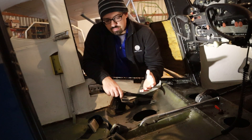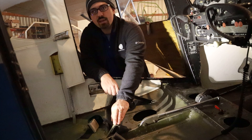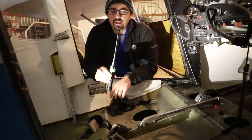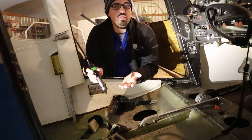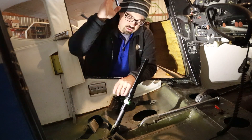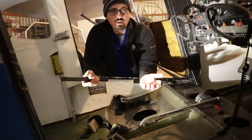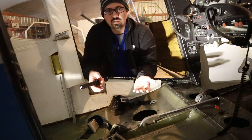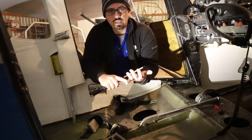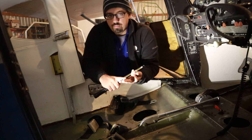I've got everything set up to comply with AD 2022-0803, verifying that this bracket is made out of steel. According to the AD, I need to take a magnet — the end of this flashlight is magnetic — and verify that this is steel. I'm going to do that now. It very much is magnetic; you can see it's just standing there attached. So the airworthiness directive is complied with — I've verified that this is not aluminum, so I don't have to replace it. I'll make the appropriate documentation in the annual entry showing compliance and the method used.